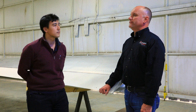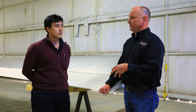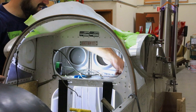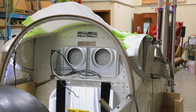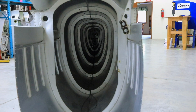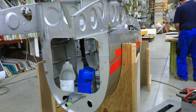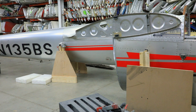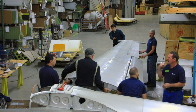There are a lot of procedures involved — not just changing a fitting, but a lot of other inspections going on inside the wing and inside the fuselage. On the fuselage, we're going to change out the center bulkhead where the carry-through is. At the factory they actually split the fuselage in half — the forward cabin section and the aft tail cone section — and change out the complete bulkhead. They sent us fixtures to be copied, and those fixtures provide alignment of the carry-through in the fuselage and for the wing fittings, so that when the wing and fuselage go back together, all pins are in alignment.